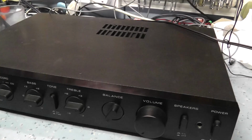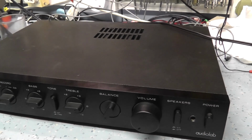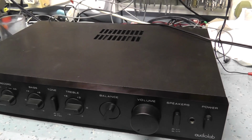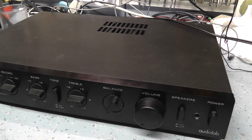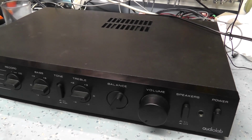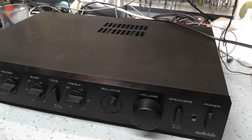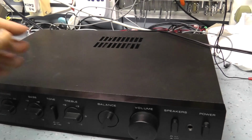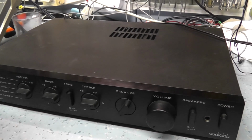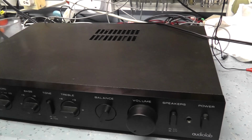The only thing I can say to end this video is these amplifiers are very nice. They sound very good, but there's not an amplifier I would recommend you leave on overnight, or when you're not using it. Don't think just leave it on to keep it warm because it's going to sound better. I would shut it off. The ventilation on these amplifiers is inadequate in my opinion. I would like to see grills put here so the whole thing doesn't build up with heat.